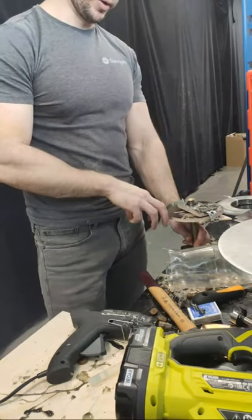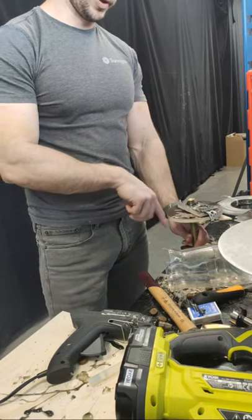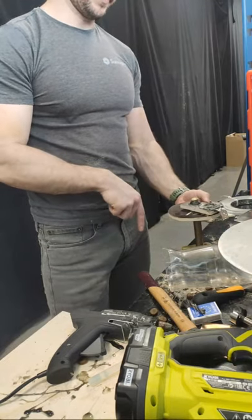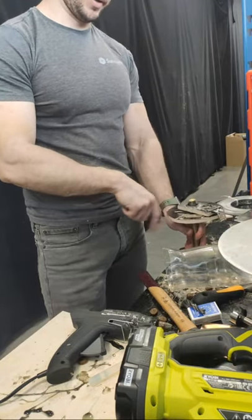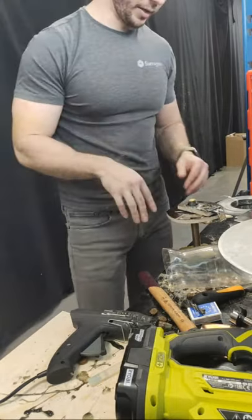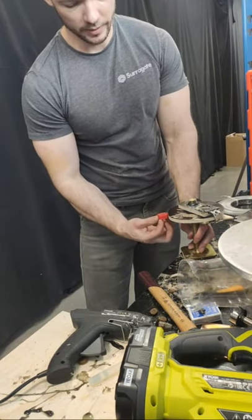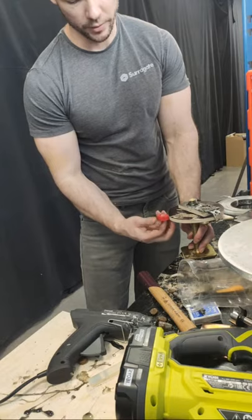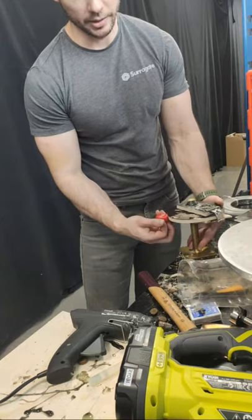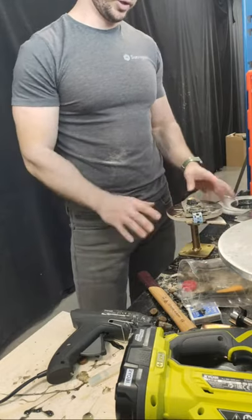And if the servo is not super fixed to this, if it jams, the servo could potentially still move and then move back and then move forward. Yeah, if it's not like a gear, right? Because we're not using teeth. So if you had this rotating and it's not on teeth, once it jams, this servo just keeps spinning until it's at its end point, and then it rotates back and then pushes the thing. So I mean, it should work. It should be fine.